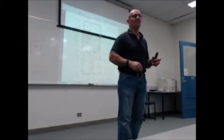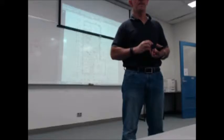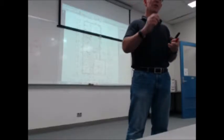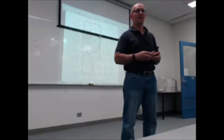But in the case you're talking about, the builder is saying, yeah, it's obvious, I can see it's beyond 2 millimetres. It's not in question. It's not an easy fix. We've got to pull the tiles up. Then the builder goes back to the tiler, the supplier, they're all having a yak at each other. But what if the supplier goes, too bad, they're my tiles? They're all trying to yell at each other, and you're standing there.